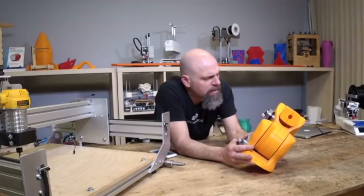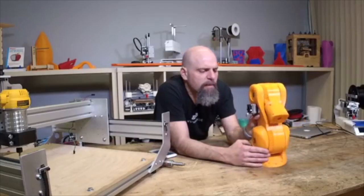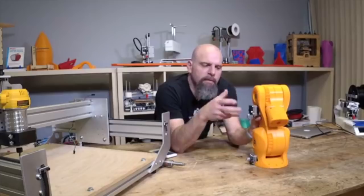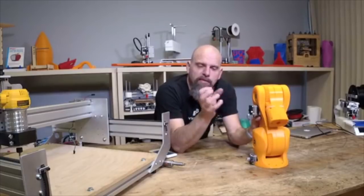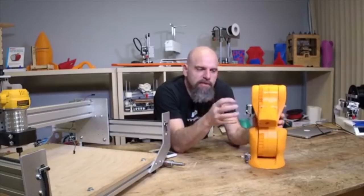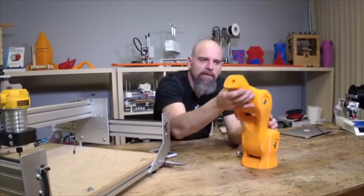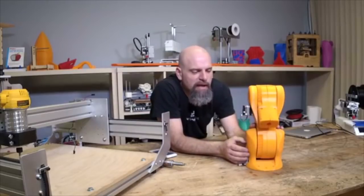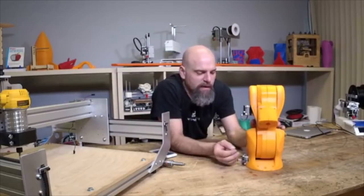What's it say? There's a couple of these out there, but it turns your stepper motor into a servo, because it closes the loop. Instead of open loop, I hope I don't mess up when it's moving, it tracks where am I, and it can adjust. So if you took the arm and went like that, it would recover. I thought it was going to be neat, and it ended up just being a pain in the butt, so we gave up.